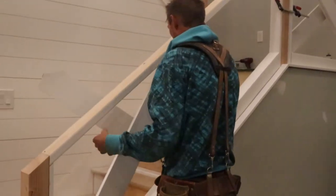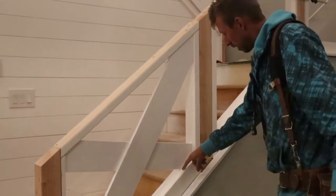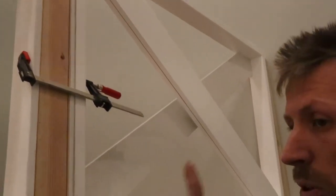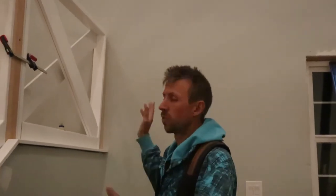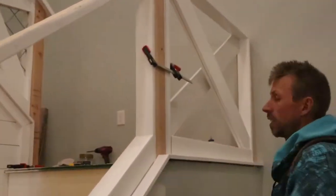We're just going to go ahead and check how this one fits. Pretty nice - the lines are pretty good. This is a stair one so it has slightly odd angles, but the principle is the same. This would be more of a square one on a larger section. You can figure it out to whatever the size your railing is - whatever the width - as long as you find the center of the board and go from corner to corner. Now I'm going to do another pair of these just as opposites on the other side.